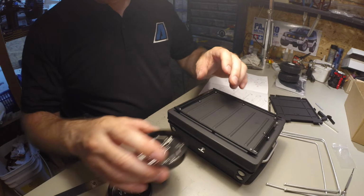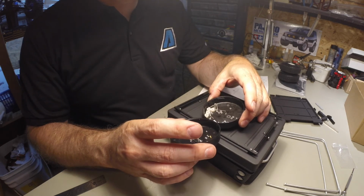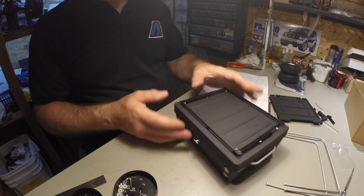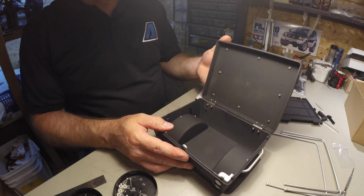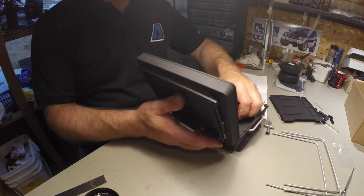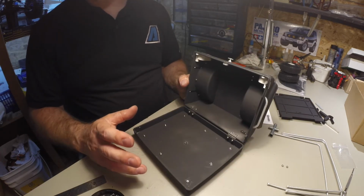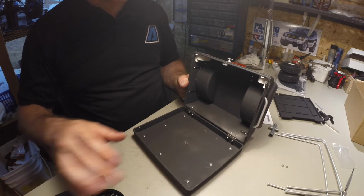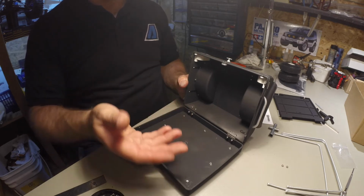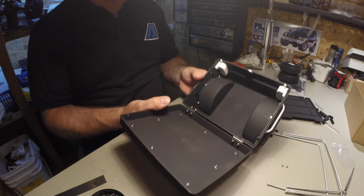I seem to have run out of lock nuts. So I'm going to take them off a certain area where they said to put some and replace them with regular nuts, because here I can just put Loctite and they'll never come apart. I'm guessing you may have this issue as well. You may not have enough lock nuts to cover everything, and there are certain places where the lock nuts have to be there because you can't over tighten in order to keep the movement going. So basically I'm putting regular nuts on these ones and keeping the lock nuts for the other part.